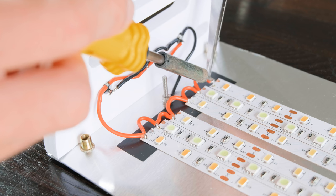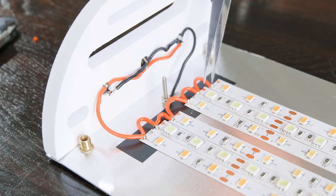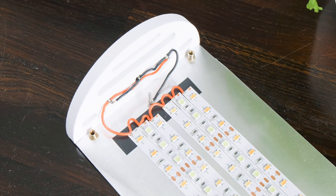The red wire on the other hand can have various sections of it exposed, and then these can be soldered to the positive tabs on each of the LED strips. With the power inputs now sorted, we now need to work on the control side so that we can adjust the brightness of each set of colour temperature strips, for which we'll need three LED dimmers. These work by rapidly turning on and off, but they operate at such a rapid rate — 10kHz in fact — that the flickering is imperceptible to the eye and is instead perceived as lower brightness. It's not visible to cameras either, so long as the shutter speed is below 1/1000th of a second. These can be mounted onto the other semi-circle and wired up to the LED strips — I've included a wiring diagram in the video's description.